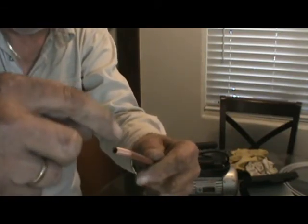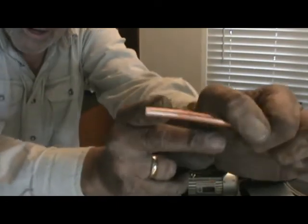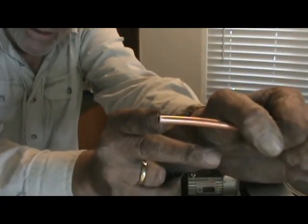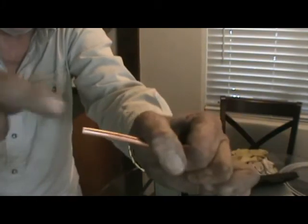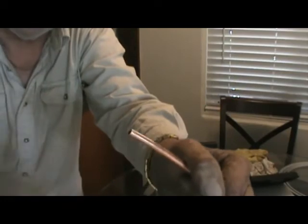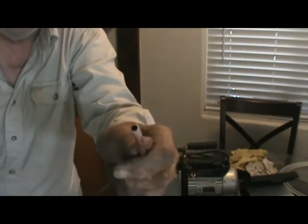And when you put the flux on there, put the heat right on the shoulder of the joint. Not way back here, right on the shoulder of the joint. And flow the solder on here, and when it's clean and there's flux on it, that solder is going to flow around in a second. And you're going to pull the heat off and the solder off, and it's going to be a nice, smooth, flat solder joint. It's not going to be bulging and a bunch of solder on there because you keep touching it because you didn't go all the way around. That's why it doesn't go all the way around.